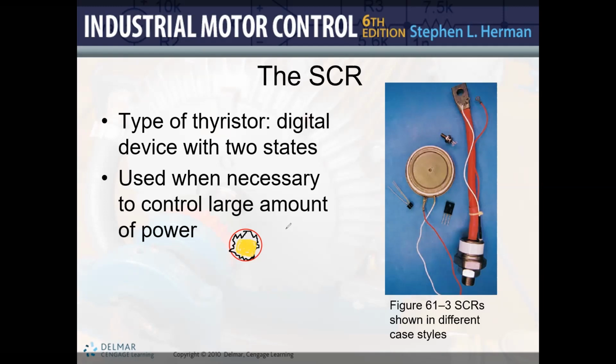However, when you have a DC transmission line, and that's what you get to do with the SCR, then the electrons will travel completely inside the full conductor. So what's going to be the advantage? Number one, you are going to transmit the same amount of power using smaller gauge conductors. And number two, you only need to use 2 conductors instead of 3 conductors, and that translates into a lot of saving, like lighter power transmission lines, lighter conductors, lighter insulations. Everything is going to be less because you eliminate the use of 1 conductor. And that's one of the great advantages of using DC for transmission power rather than using AC.